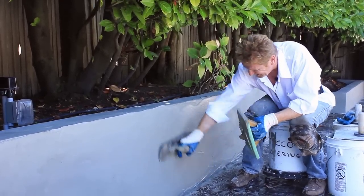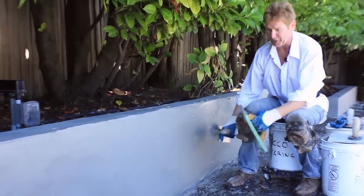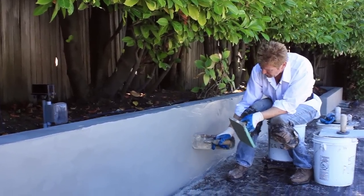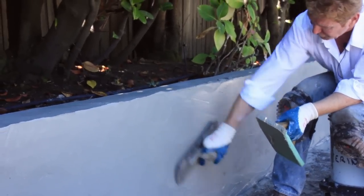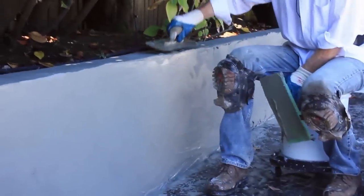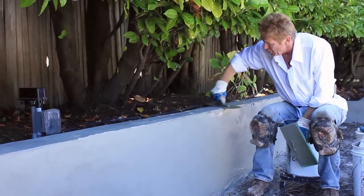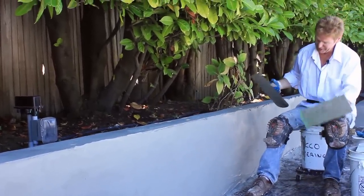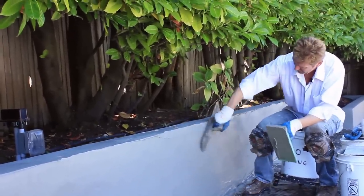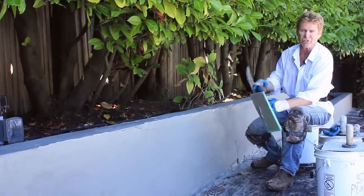In case any of you have ever done this: the paper shouldn't touch the wall — otherwise when you're done, you pull the paper and pull out the whole bottom. Here's that sand again — we have little bits of sand throughout this mix. We're trying to go a little heavier to cover that extra, but you don't want to go too thick. If you go too thick on a finish coat, you get hairline cracks and chatter marks. Always make sure you get the right fine sand, or just get it pre-bagged.